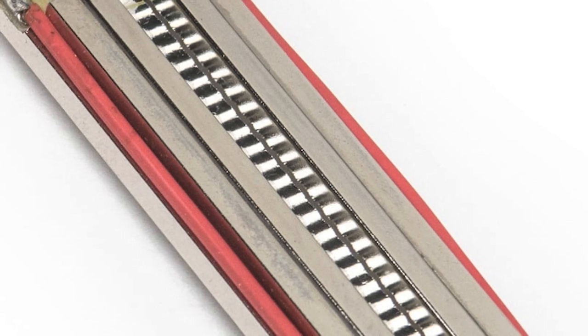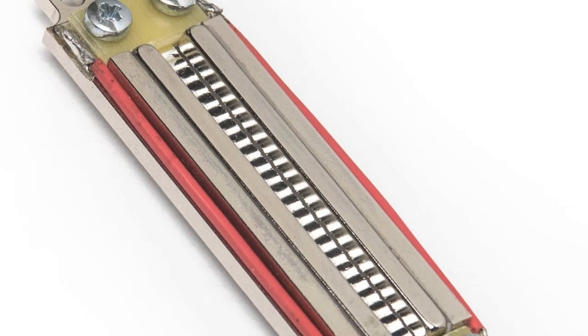The aluminum ribbon is suspended in a field of permanent magnets, and when sound waves strike the ribbon, it vibrates and cuts the magnetic lines of force. Most ribbon mics use a step-up transformer that amplifies signal voltage from the ribbon element by around 37 times. There are several variations available now. Many of the ribbon mics are passive. Some of the ribbon mics used in 1930s recording studios are still favorites today.